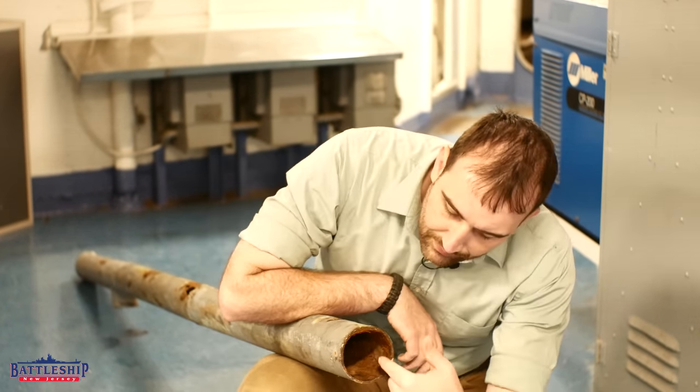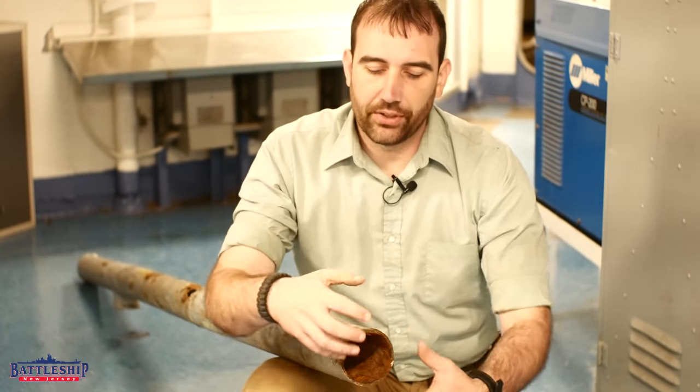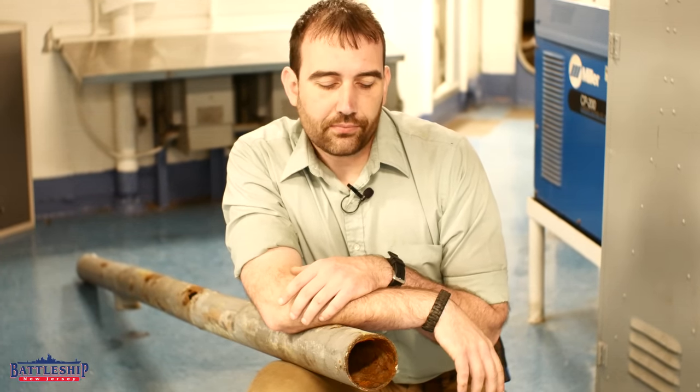You can see there's a tremendous amount of rust building up on the inside. It's not like red flash rust that you see — it is the built-up pack rust, or as I like to call it, rust bloom, building out as this steel tries to return to its natural iron oxide state. And there's nothing you can do to fix that. You can't get inside that pipe and needle gun it and paint it. Once it starts to leak, you've got to cut it out and replace it.